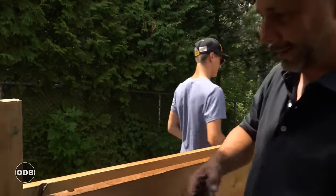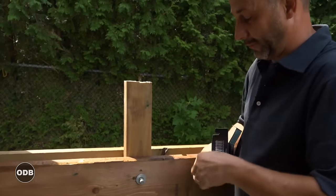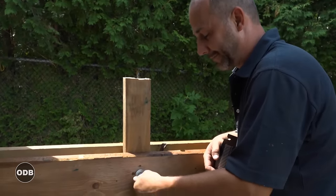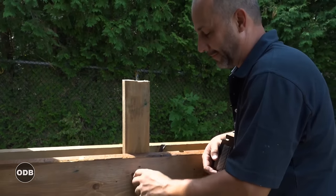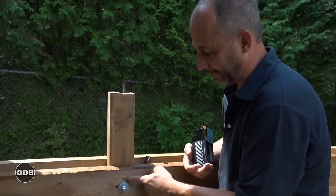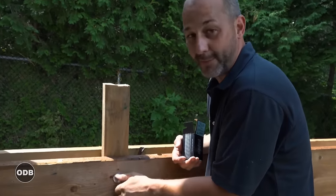It's important to note: that drill bit with this nut and bolt is an exact fit. You have to hammer the bolt through the hole, which means it's a direct load transfer. When we've got these boards leveled off with the screws, they're not going to move around because there's no extra space for that to happen.